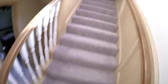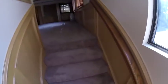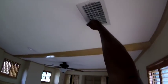All right, I'm just going to go ahead, and if they want to do it, fine. If not, it's all good. I do at least want to take a peek at the air handler unit. Yep, I already feel like it's been cool. But I need to at least watch the coil, flush the drain lines, because a lot of people don't know it's really important. Oh man, no light. I gotta start charging for them light bulbs. I ain't bring my flashlight up here with me.